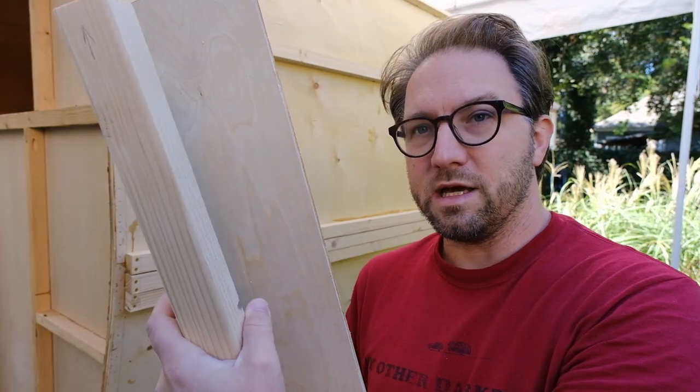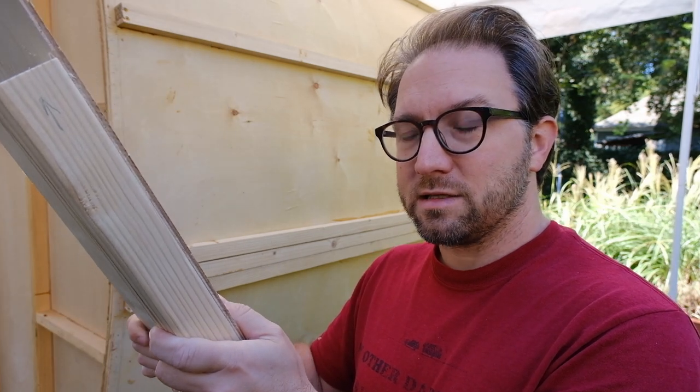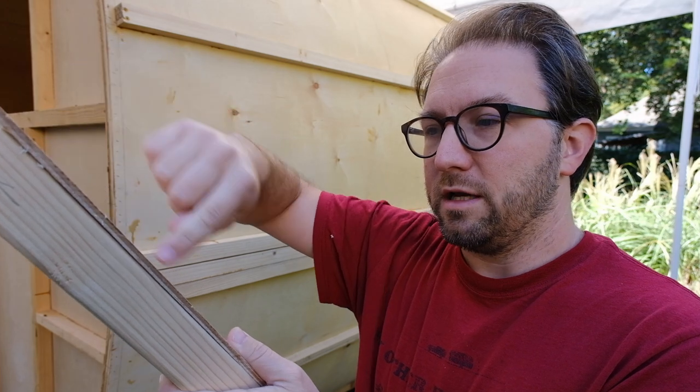So now, if I take a quarter inch piece of plywood and I trace that curve on it and cut this out on my jigsaw, which is a lot easier to do than cutting through this thickness on a jigsaw, I can take this, once the curve's cut in it, clamp it down on the top of that, take that new bit I have, let that bearing ride along this curve that I'm cutting in this quarter inch, and cut through most of this, then switch back to the other bit and cut the rest, and it should be nice and even and smooth, and in theory, not take very much time.